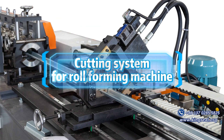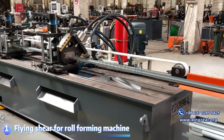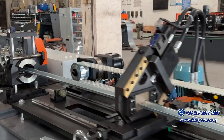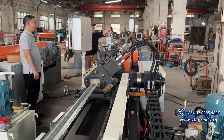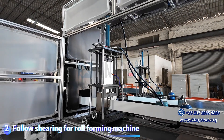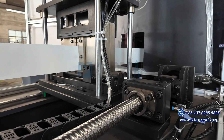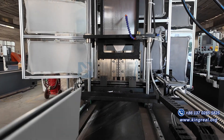For the cutting system, the Flying Shear operates at speeds usually above 60 meters per minute, which is suitable for large-scale production needs. This shearing method completes the shearing task at high speed, ensuring production efficiency and finished product quality. The Follow Shearing system operates at speeds between 30–60 meters per minute, and the specific speed needs to be designed according to the actual production situation of the customer.